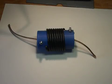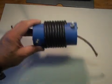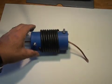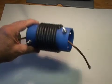The RX bridge can be used to measure the resonant frequency of coaxial traps. Here is an example of a W8NX trap used in multiband dipoles as published in the ARRL handbook.